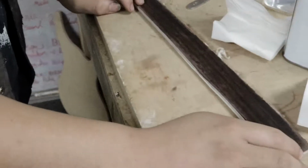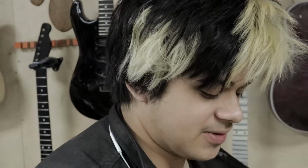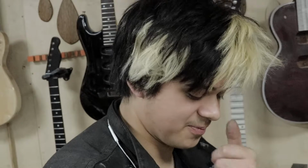Okay, so the issue is that the lacquer is basically not adhering properly. There's two issues we're having. It's either a reaction with the wax in the rosewood, because it's quite a waxy wood, or it's just not sticking to the sealer coat. So we're trying to work our way around that. What have you tried so far? Just the old polyurethane lacquer, acetone, things like that.